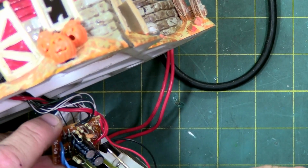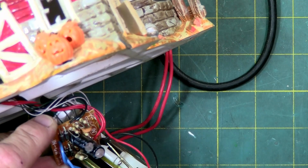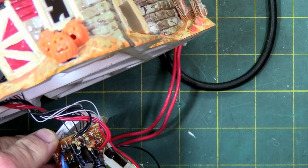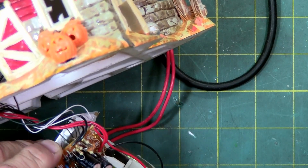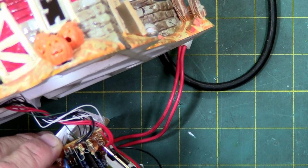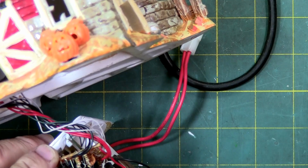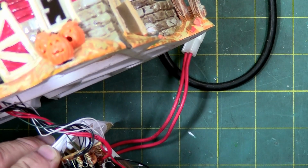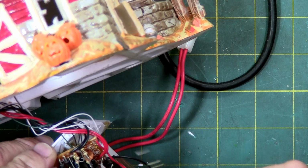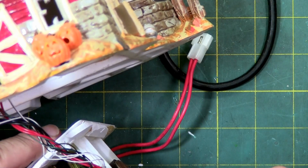We got a transistor, which looks okay. This thing right there, next to the capacitor, this black thing. The two capacitors aren't bulged, and they don't appear to be leaking from the bottom. There's no stains around them. This right here is also a capacitor. It's a ceramic capacitor, this orange. It's not cracked. Usually when they go bad, they crack. All the resistors, I can still read the color bands, which indicates they're not burnt. There's a Zener diode in here.